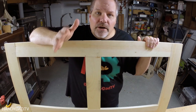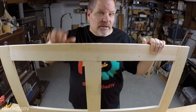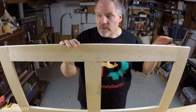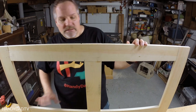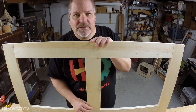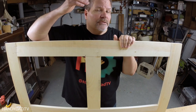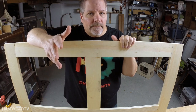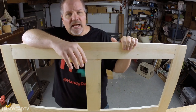If you want to be a woodworker you got to realize there are multiple ways to skin a cat — a lot of different ways to join wood. On this piece we are going to talk about five of them: mortise and tenon, dowels, biscuits, pocket holes, and half-lap joints. There's a right time and a wrong time to choose them because they all have a different strength profile, and some are more difficult requiring specialty tools.